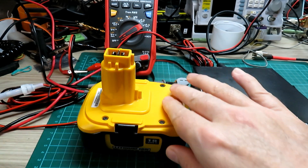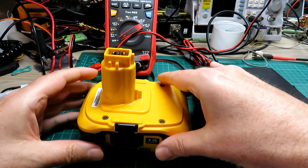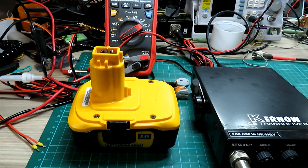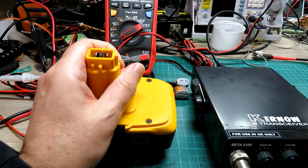I use this all the time for jobs and it's still absolutely fine. People say, "hang on, this is 18 volts - I can't use this," and you say: well, you can. One of the primary reasons is voltage regulation. Now, you could use a simple voltage regulator, but nowadays the buck-boost converter type of power regulators are so cheap and flexible that they give you so many more options. So you can use this as your power source.